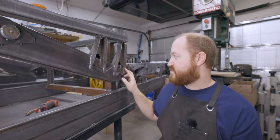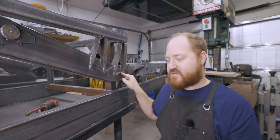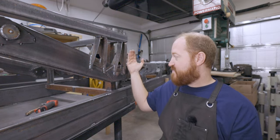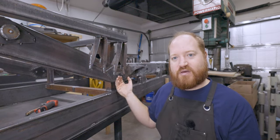On the front double-up plates where the bracket welds to them on the side, I actually drilled holes and did some plug welds right where the arms of the bracket attach, so that if this ever bends back and forth it's not pulling the plate away from the main frame — they'll be moving together.